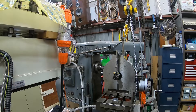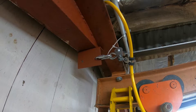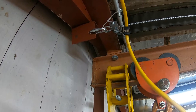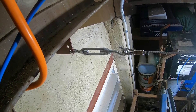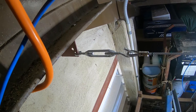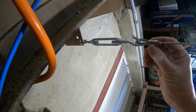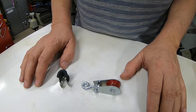For completeness, I've included a shot of each end of the support cable. You can see the eye that's swaged in there, and the final runner is just tied to the end to keep it under control. At the other end of the support cable I included a turnbuckle to allow tension to be put on the cable. I swaged these on using a handheld hydraulic crimper.